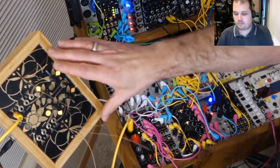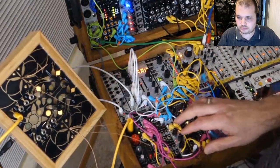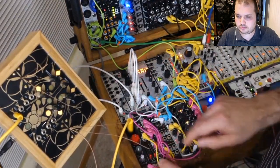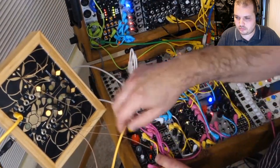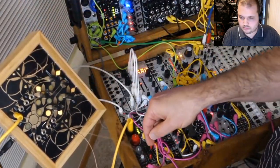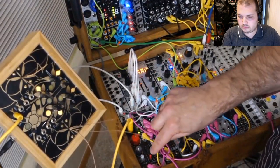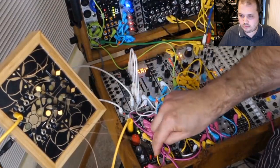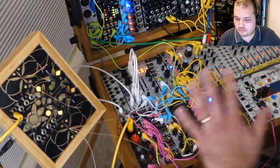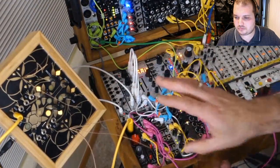Yeah. And that's because the audio level is just fluctuating above and below the threshold of the envelope follower. It does not do that when I have the level set to modular. It does do it when I have it set to line. The release time does affect it. It tends to be more stable with a long release time. Try to bring it down and start getting that arpeggio. That's the wonders of learning the idiosyncrasies of hardware and how you can use that in performance. Do I want that arpeggio effect or do I just want an individual note?